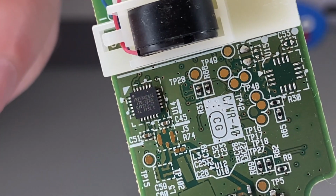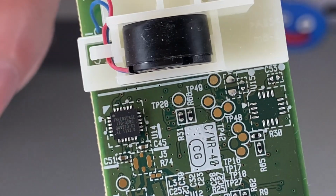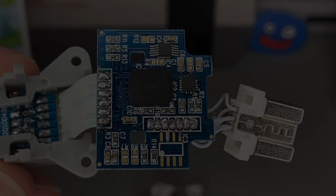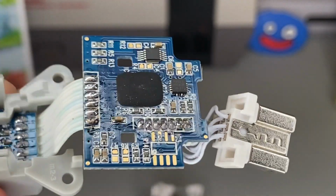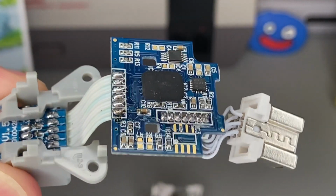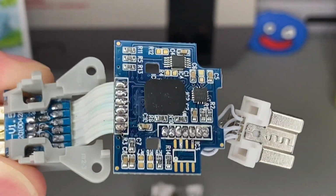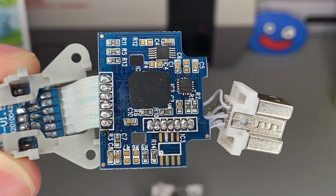I have no idea what the differences are between the chips, but I'm assuming this is a gyro sensor built specifically for use in Wii Remote Pluses. But other than the gyro sensor, we should probably have an analog to digital converter to convert the analog signals from the gyro sensor to usable data, as well as a microcontroller to make everything happen. However, that's obviously all speculation on my part because I have a fake device.